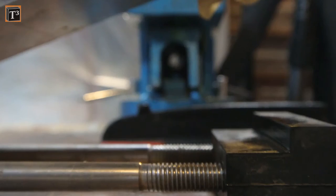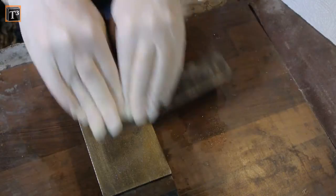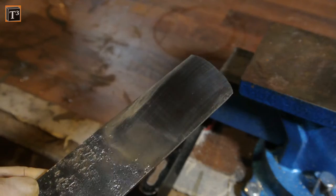All of it needs to be removed. I realized that the 400 grit stone would not take off material quickly enough and switched back to 140 grit. There was still a low spot further back but the important thing is that you have everything flat at the tip. Now I could switch to the next finer 400 grit stone again.